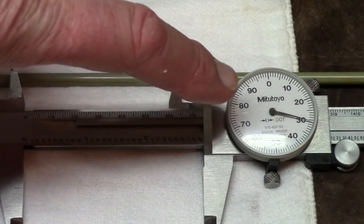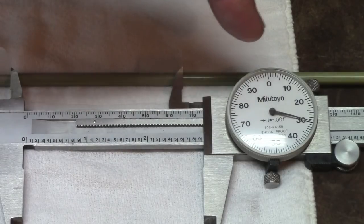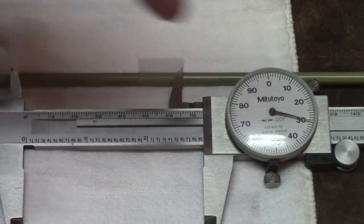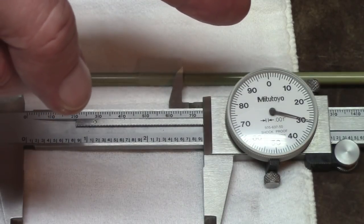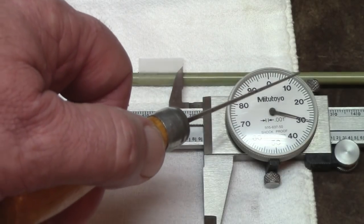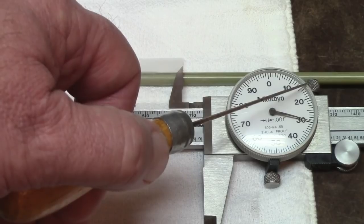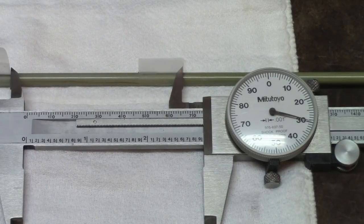So from this point here, we start out. It's a pretty simple number. We simply change it from 930 to 900, and that's our starting point. We've shortened the cartridge just by 30 thousandths of an inch, and then as we remember never to get any closer than 15 thousandths of an inch. Okay, so you start from the 0, and then you're only working up between this number here and this number here. From 0 to 15 is our closest that we want to be to this number,